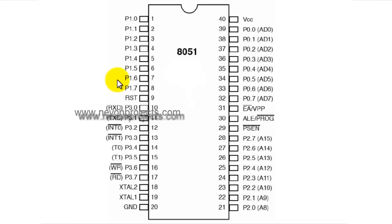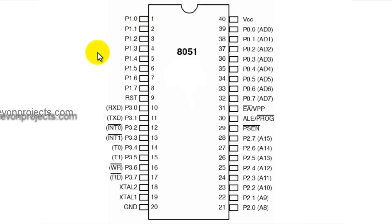When this is done, the P0 register will read a value of 0x01 — it is only 1 bit high at pin number 1. Similarly, if we want to write a byte on port 0, we can write it on the P0 register. In a language like C, we can do this by assigning it the value 0x01, which is the hex value for the binary 00000001. This is how we set a pin high through the program in the 8051 microcontroller.